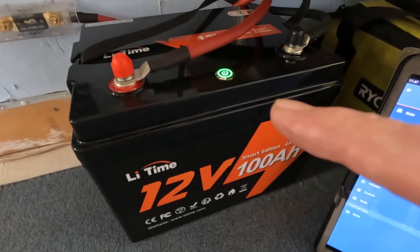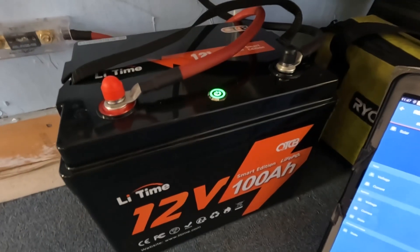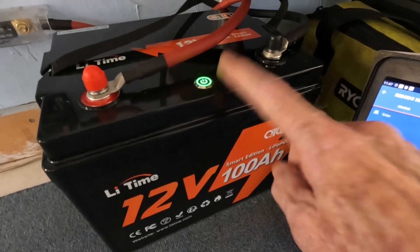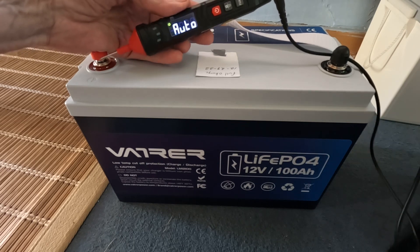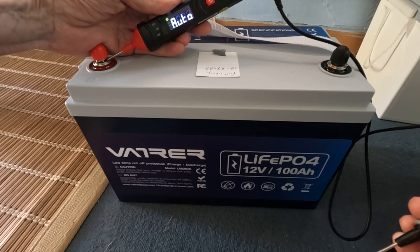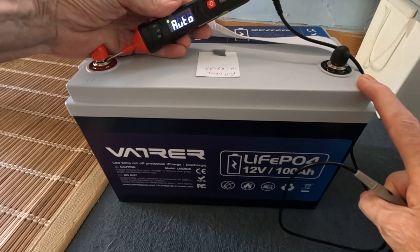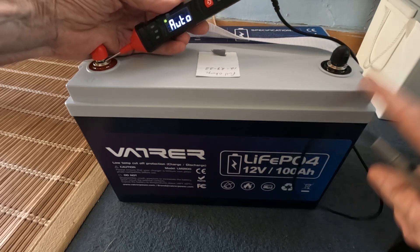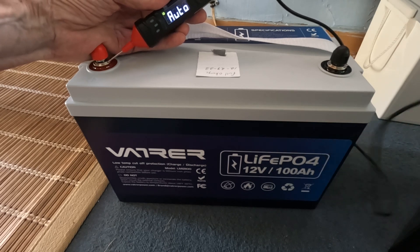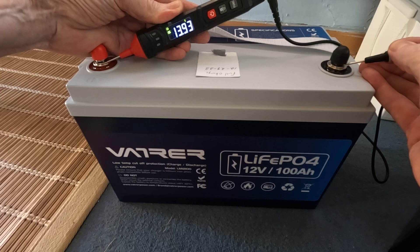Can't wait to see this in action. I'm going to be curious to see what it does once it stops charging, since I originally had it in the off position — when the charging is done, will it go back to the off position or will it leave it on, ready to discharge? We will see, because it kind of threw me that it automatically turned on. I thought maybe I'd have to manually do it for charging but did not. And when I say I've been charging these batteries to full, I've been letting the Victron take them up to 14.2 volts during its absorption phase, holds it there for a couple of hours, then tapers off to no charge as it settles down into a 13.5 float. This battery's been sitting here fully charged, disconnected from everything for a couple of days — and I'll show you what it reads right now: 13.93 volts. So it is very slowly going down, holding up a very, very good charge.